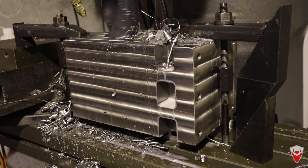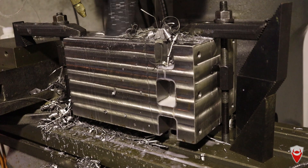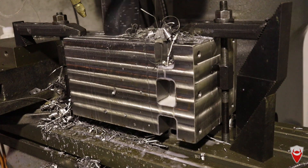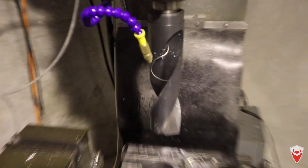So there we have it — the hole was successfully drilled. Take that, naysayers. In all honesty though, the mill was barely able to drill that hole, even though it had a 30mm pilot running through it. I did stall the mill a few times, and I think I wasn't able to keep enough cut pressure on it to prevent chatter and vibration. But it worked — I have a hole, and the inside of it is surprisingly nice despite the sounds the mill was making.